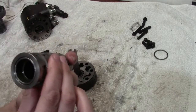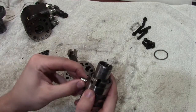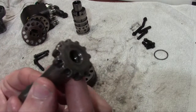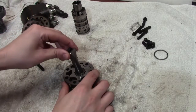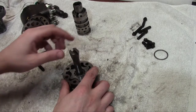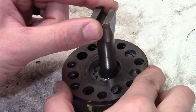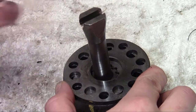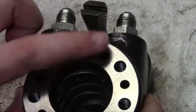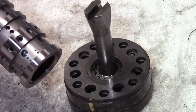That saddle right there drops onto that pin that's down in there. This pin right here locks onto that to form your drive link, which is this part here. As you can see, that's all rounded over so that as this thing wobbles around it keeps that centered, because this is always going to be staying centered in the valve section. It has to be able to wobble back and forth in order to maintain that centered layout. You can see as I turn this, it opens it up and closes it. When it opens up, it's pulling fluid in — that mechanical push through there will pressurize that fluid, force fluid into each of these or pull it out, and help route it through the valve section to steer left, right, or straight back to the return tank if everything's open.